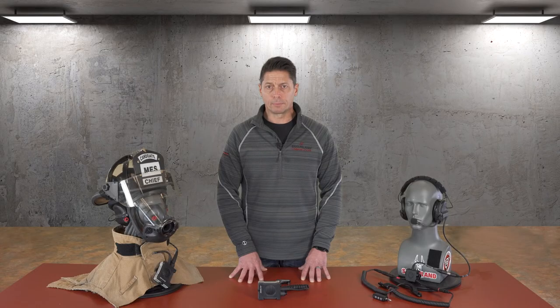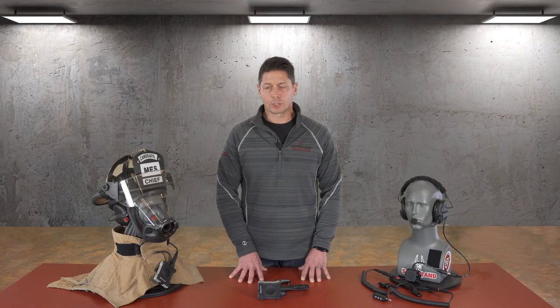The coiled cable can also be a failure point where the cable is continually overstretched or twisted, which can cause breaking of the inner wires or overstressing at the strain relief. Whenever possible, route the cable so that any slack is managed to avoid snags during operation. Communications equipment should be inspected for damage after any hard use, and an operational check should be performed before the system is placed back in service. An operational check should also be performed every time equipment is removed or reattached to the portable radio.